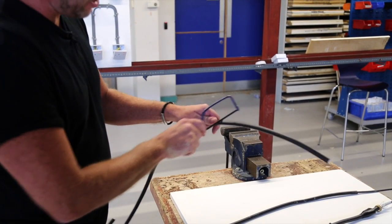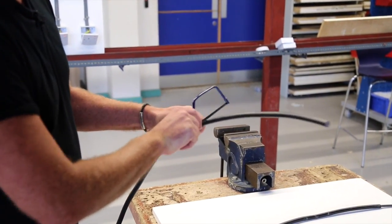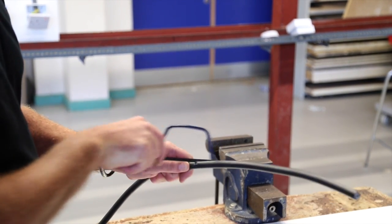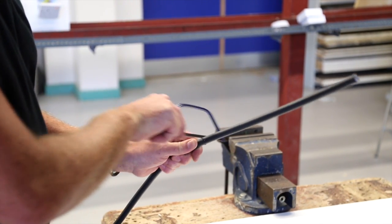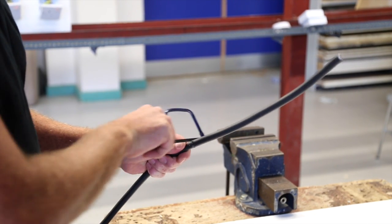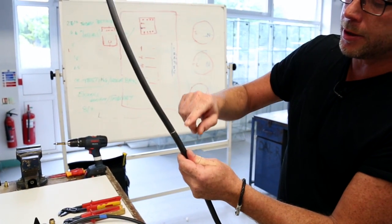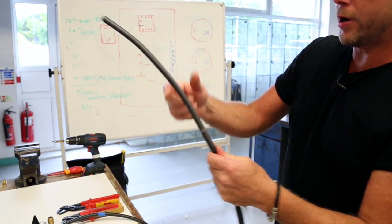You may start to hear that I'm actually cutting into the steel-wired armoured. What's important here is that you cut a groove into the armoured but you don't actually go through the armoured. Once you have cut round through the outer insulation and made an indentation within the steel-wired armoured, you're ready for the next stage.